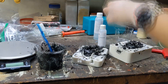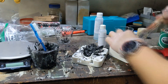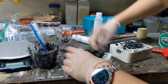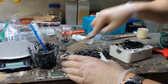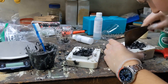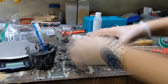To fill the mold, you're just going to sprinkle some dry carbon in thin layers, then dab that with a paintbrush and coat it with epoxy, and keep doing that layer by layer until the mold is full. It's going to seem like you have a lot more carbon than you can fit in there, but I promise it will all fit. You have to pack it in and it's going to be a heaping pile, which is why we added that extra sidewall on the mold. Once you've got all the resin in there, you can move it over to your vise or clamp so we can compress it and get the real forged carbon and squeeze all that extra resin out.